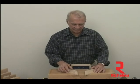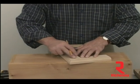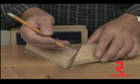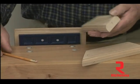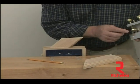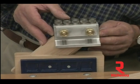The next demonstration involves a miter joint, and it's 2 1-inch by 3-inch timbers, and it's exactly the same process again. The reference faces are marked with a check mark, and in this case we mark these two edges up here and an X where the face is to be drilled. Place the first workpiece in the vise, and once again check mark to check mark, and bring the Dowelmax up to the apex of the miter.